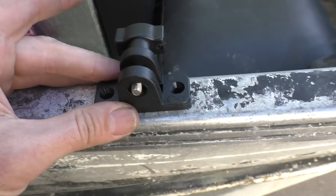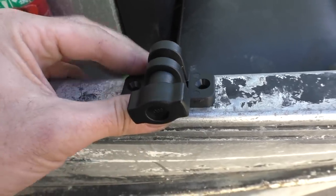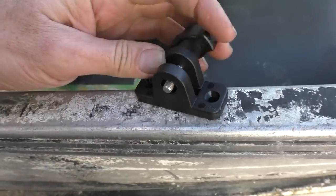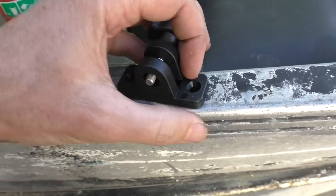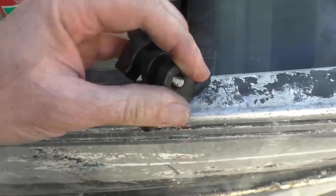These are the plastic bits we now need to attach to the gunnel in the position we just determined. We're going to drill them on - it comes with some stainless screws. I'm not a huge fan of screws; I'd probably rather rivet it, but it does mean I can easily move it if it's wrong, so I'll use the supplied screws to start with. This fitting is going on the gunnel here, but we're going to have the little knob fastener on the inside rather than the outside, because otherwise if you ran along a pile or something it'd break off pretty easily.